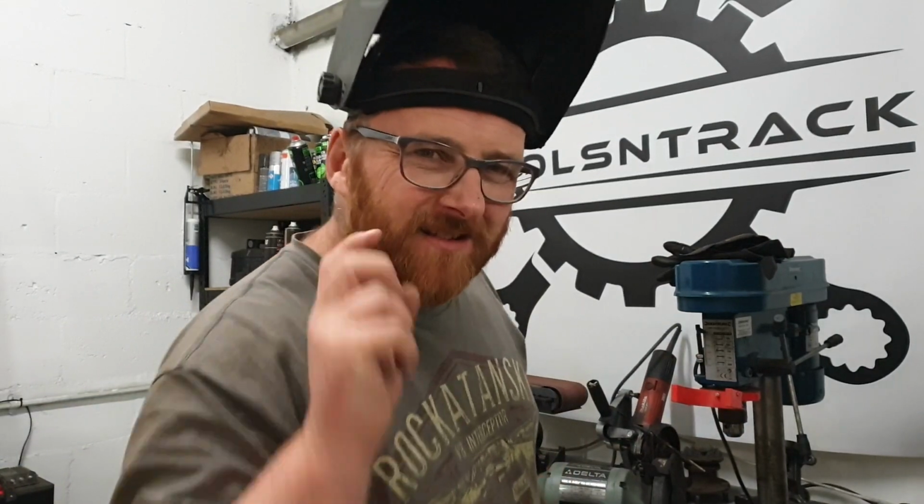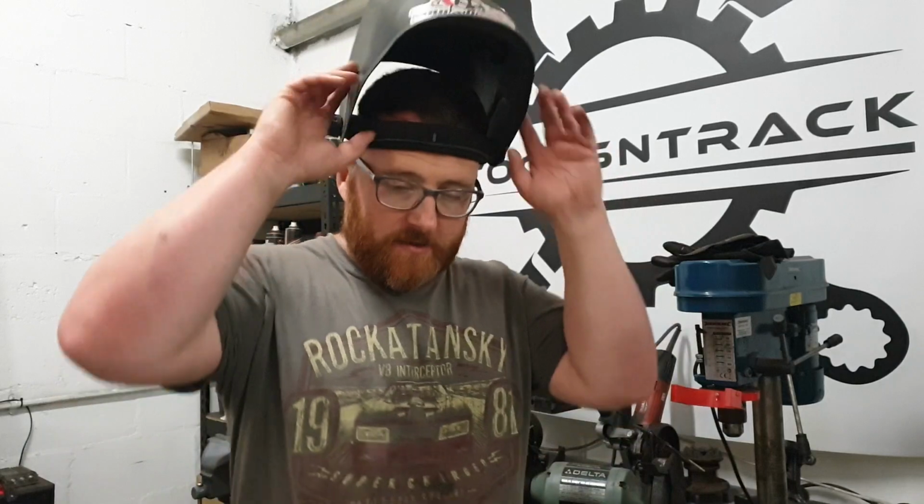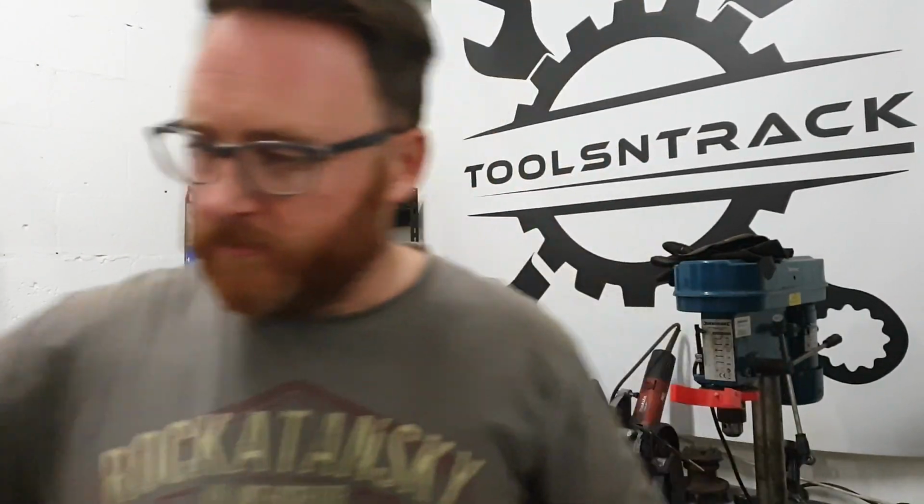Okay, so that's the rear arms done, jig work sorted. All that remains now is to put our U-clamp on with a bit of threaded bar and we're finished. However, it's not quite that simple because whilst I have managed to secure the correct 18mm threaded bar, attaching it onto the U-clamp is going to be tricky. As you'll know, getting a weld on and making sure it's as strong as possible is bad enough on the frame when we're thinking about triangulation. Putting just a simple bar onto a U-clamp without any form of actual reinforcement is probably going to give us some problems with strength.